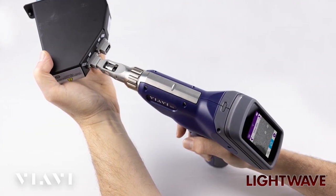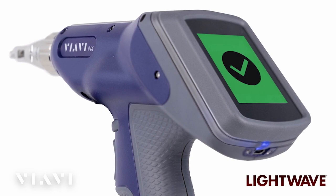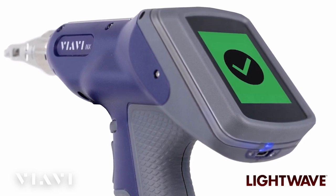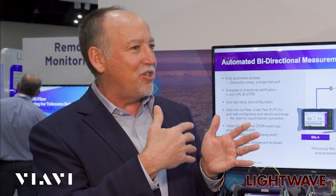We also have a panoptic optical-mechanical mechanism in the fiber inspection scope that allows it to scan across the entire ferrule. A great example is an MPO connector where you have guide pins, holes, and multiple rows of fiber connectors. You want your fiber inspection scope to scan across there kind of like a telescope going across the night sky, looking at everything — at all of the fiber end-faces themselves, but also on the outskirts where the guide holes and pins are, where debris gets lodged and can come loose and get into the fiber end-face.